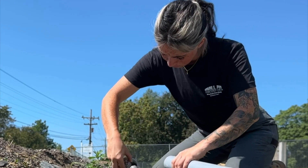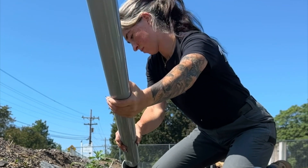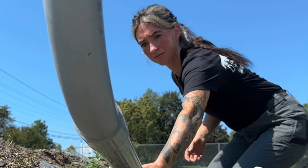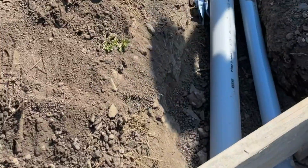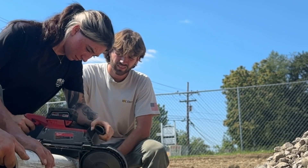Basically what's going on here is we are coming out of the transformer for some more power because we're running out. We are installing a bunch of vacuums into this space and the customer didn't want to cut concrete, and we ran out of space, so we're going to put everything outdoors now. We're basically laying the pipe so that way we can form the concrete for the pad that we're going to be needing for all of this new equipment.